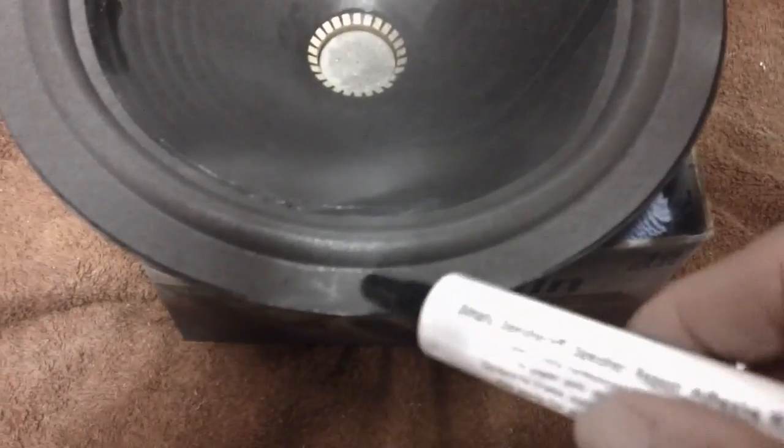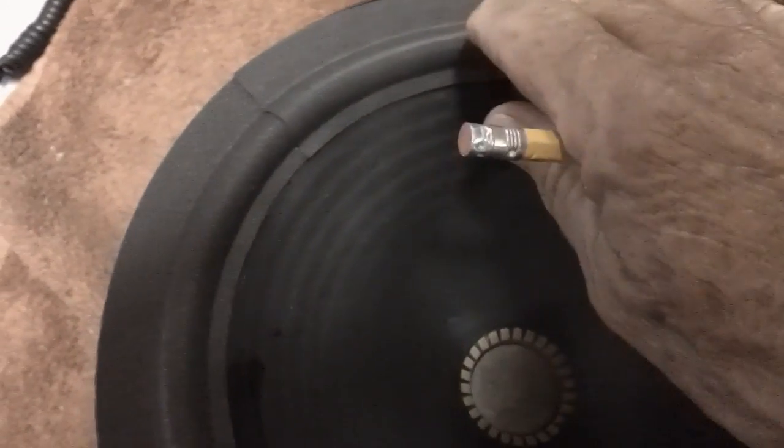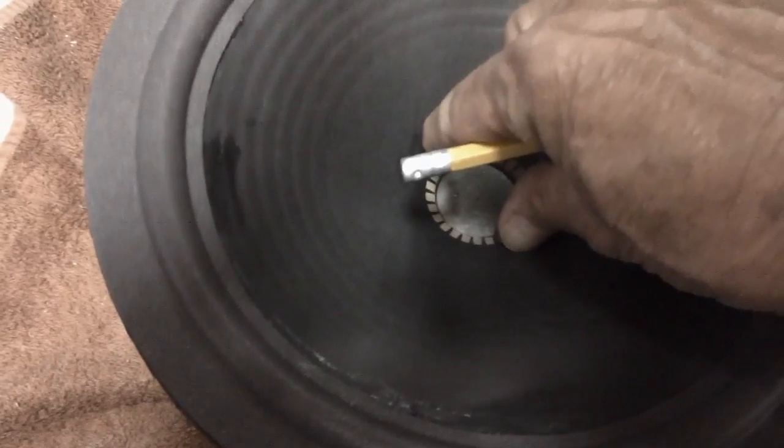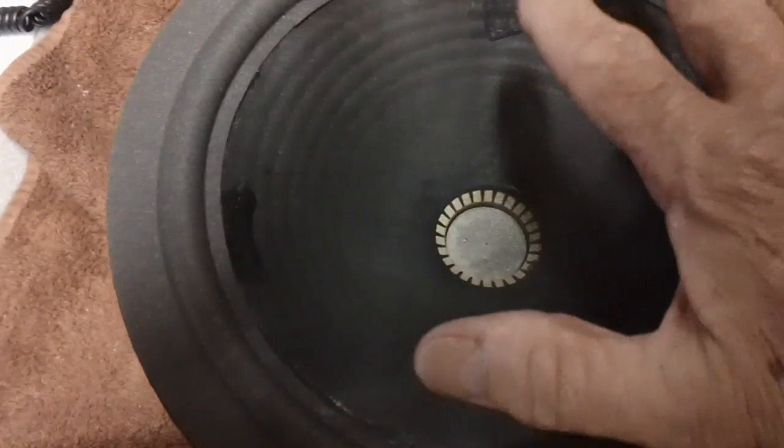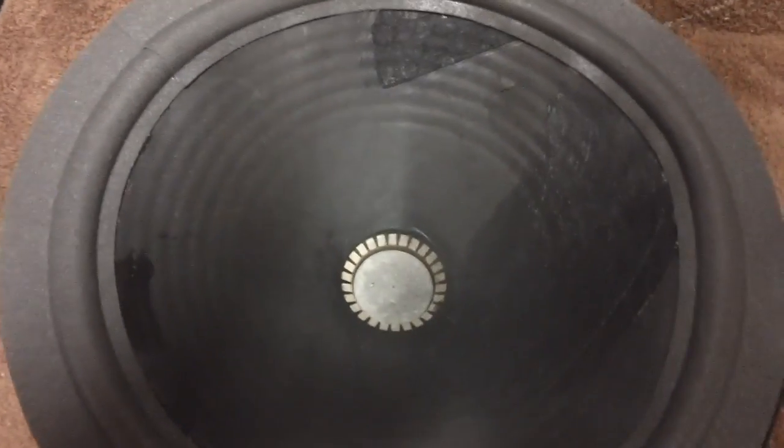Then all I'm going to have to do tomorrow is lift up the lip and put a bead of glue all the way around underneath this foam - just a nice bead, you don't have to smear a ton of it. Then press it down with your hands, and as you press it down, you have to constantly be checking to make sure there's no rub on the speaker. And once you get it where it's supposed to be and everything's quiet, the glue will dry. Then you'll test the speaker again and it'll be rubbing again - that's always the way it is, but it'll be too late then. So be prepared for that. Tomorrow morning I will finish this thing up as far as the surround goes.